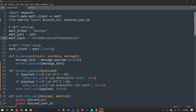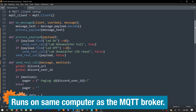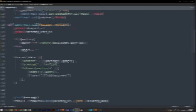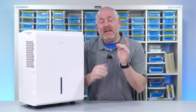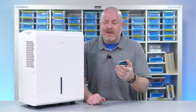The last piece of the puzzle is a bit of Python magic. This script subscribes to the MQTT broker and listens to the same topic as the LED detector. Depending on the message it receives, it sends a REST call to a Discord webhook. Discord is a chat service and that webhook lets messages appear in a special channel. The reason I wanted that is because it provides a way for me to get logging messages while running on battery, and more importantly, notifications to my phone.